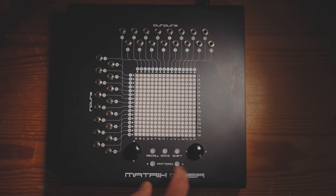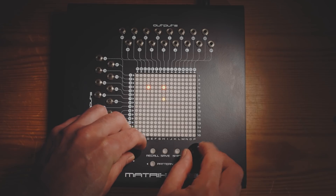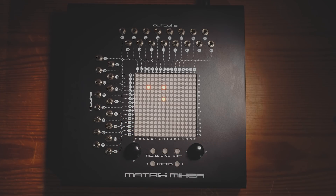If I choose a point and click down on this control on the right, you'll see it goes brighter there. What I've done is connect input number four to output D. If I move off, you'll see that the LED is permanently lit there. And that's all you do — connect any input you like to any output. You can connect multiple inputs to the same output, and you can have multiple outputs connected to the same input.